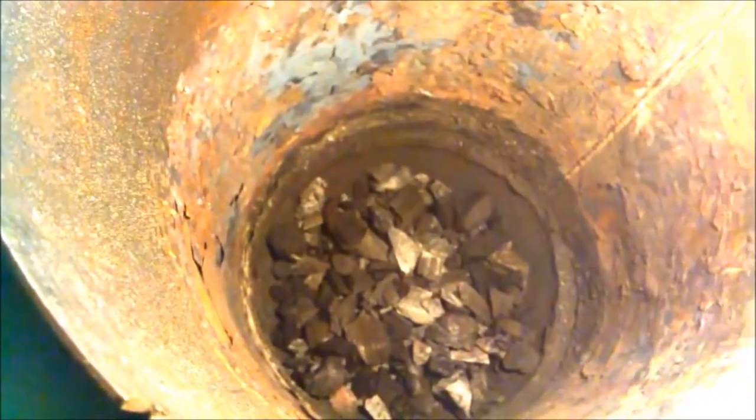Here I am again. There is a load of charcoal in the gasifier, I have the Bunsen burner flare ready, the blower is on, and I have something like 30 millibar under pressure, temperature zero at the output. Let's do it.